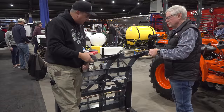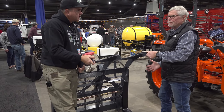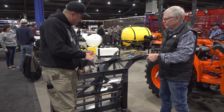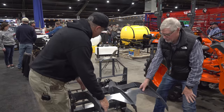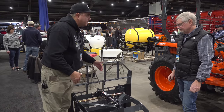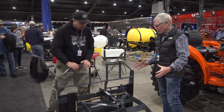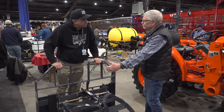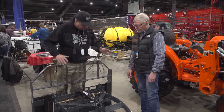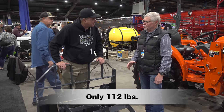We're lifting this up here with no hoses connected. The opening is 45 inches from the forks up to the tip — that's quite a big opening. With this approach, you could actually mount it offset on your frame if you wanted to. You could also mount your forks inside the actual grapple if you wanted to put them in closely. If you're using it for a big brush pile, you'll probably want them farther out; if you're picking up smaller stuff, you can put them in between. The grapple weighs 112 pounds — that's with the cylinder.